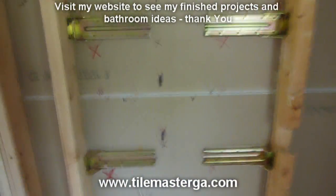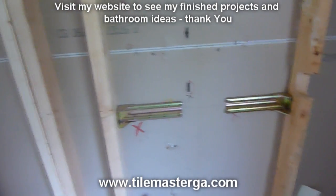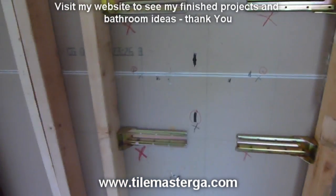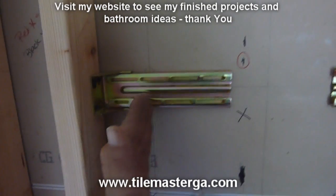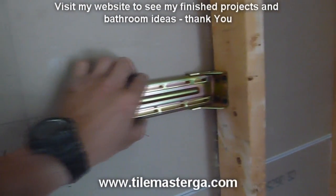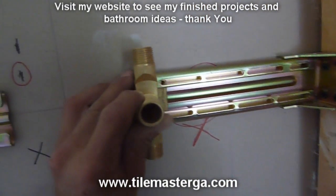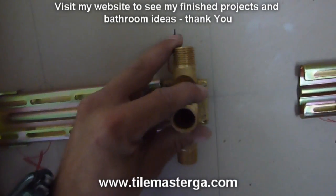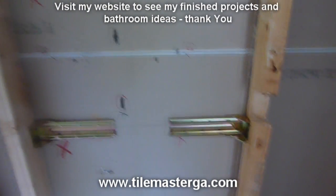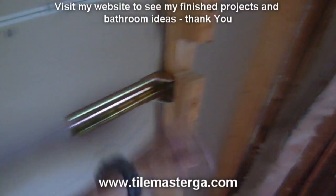How to start? First of all, I'm starting by nicely measuring and figuring out where I want the sprayers to be attached. This will help me design all the additional piping needed because many of the pipes later will go on top of those brackets. These are the mount brackets for the rough-in for the sprayers that come with the kit. We can nicely adjust positioning to our preference — it slides inside to whatever position we need. Very interesting, and we will have four of those. I'm starting from this because later there will be several pipes that have to go on top of the brackets, so it will be too late to mount those later.